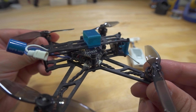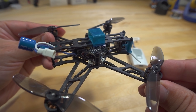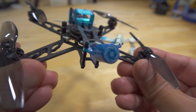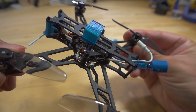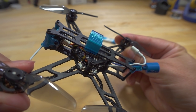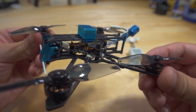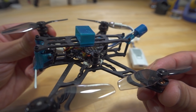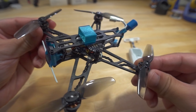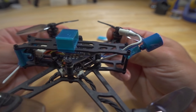You've got that all-in-one flight controller board — I did show that in the previous video on the ExpressLRS parts a few days ago, and I'll link that down in the video description if you want a closer look. It's an F4 flight controller with a built-in ExpressLRS receiver and a micro-FL antenna connection on the board. It's a 1 to 2S board, 12 amps, up to 25 amps burst — so for 1S, there should be plenty of power available from the ESC.